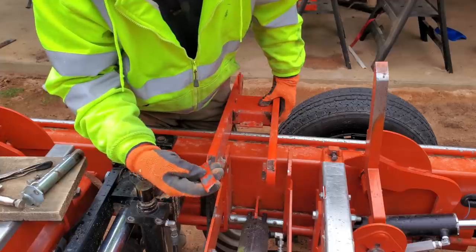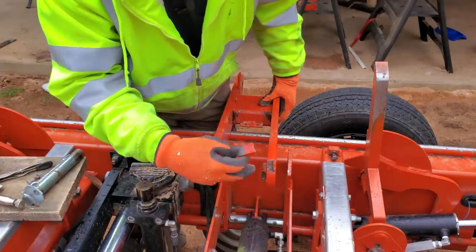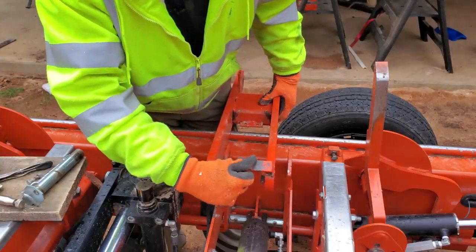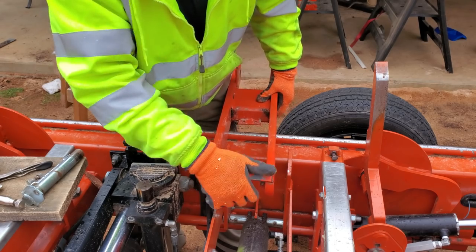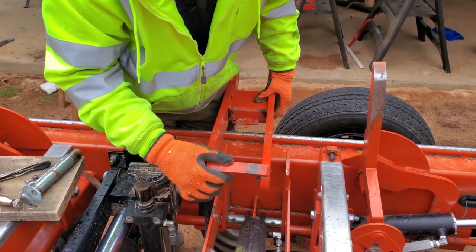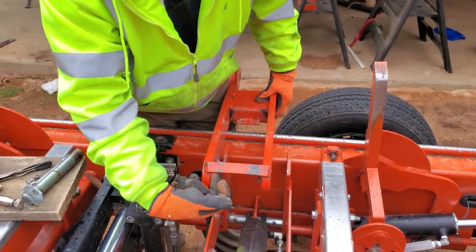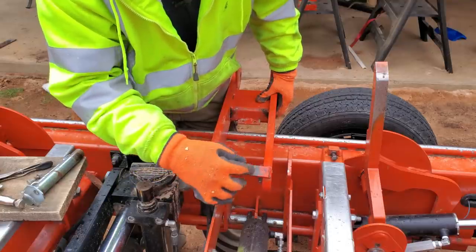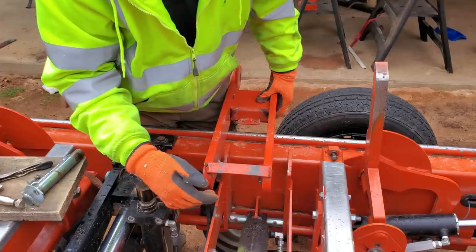It's a hard combination because you've got quarter inch steel welding into, what's this, 5/8, half inch. So got to get the right settings for that. So we're going to go ahead and, I don't know if we can just put that right back on. What I might do is weld it inside of here too. No, I can't do that. It needs that clean area to pivot on. So it's only on the outside. Let's go ahead and get all this stuff cleaned up and get some fresh surfaces to work with.